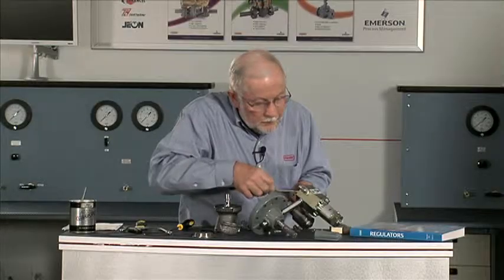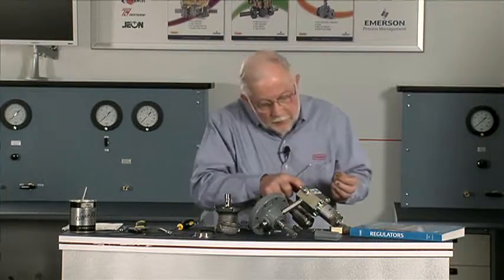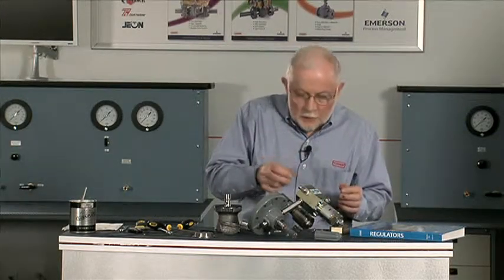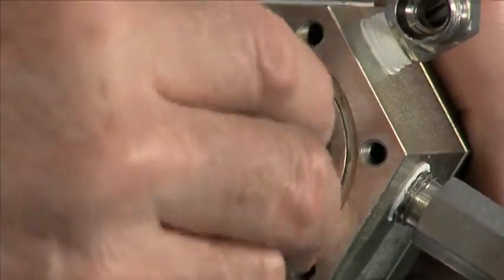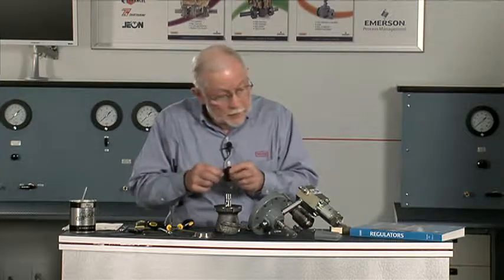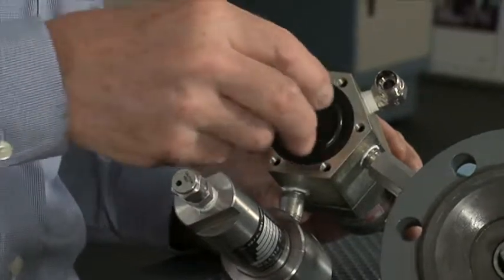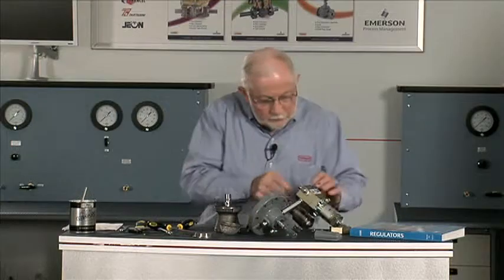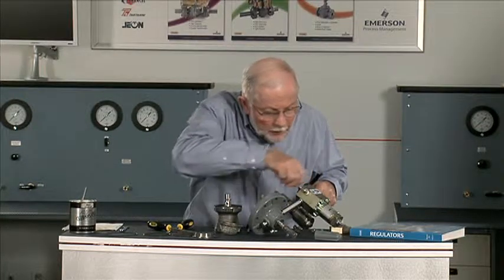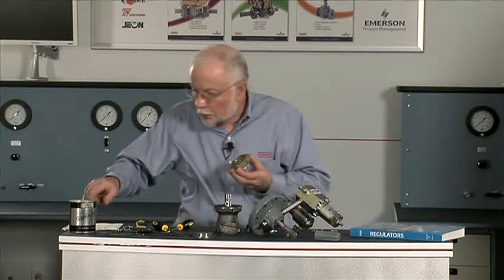The seat is coming out next — this is a disk that has urethane embedded all the way around it. The orifice in here is a little knife head seat, and you can see that it's offset to one side. So if I get a spot that's getting worn in the disk, I can merely rotate it a little bit and I'm ready to go again without buying any new part. Put that back on there. The diaphragm looks very good here. The diaphragm head has little serrations on it which grip the diaphragm on the bottom. There's a lock washer, then I put the nut back on. It's important that I hold that stem as I tighten this up so I don't allow it to turn and twist up my other diaphragm.